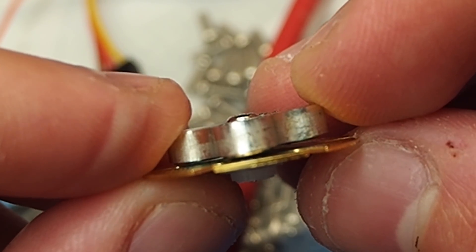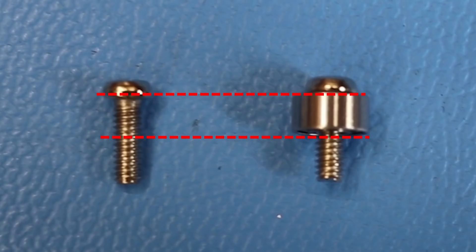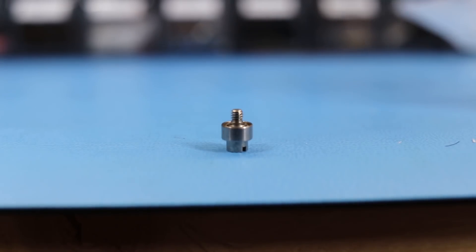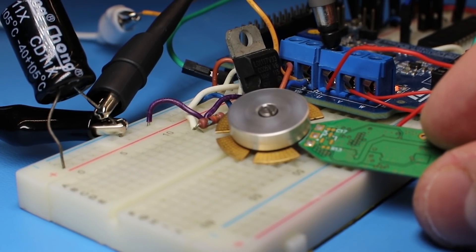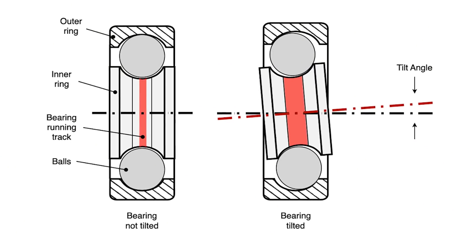The next thing I want to discuss is the wobble. The rotor has some play happening because of the bolt and the bearing. My current M2 bolt is fully threaded, so I wanted to try having part of the screw unthreaded so it fits more robustly inside the bearing — this is called a shoulder screw. Unfortunately I also had to custom make it because I couldn't find any M2 samples available. The motor ran very smooth with this change.